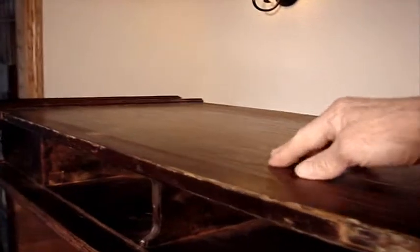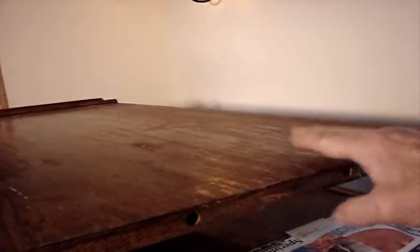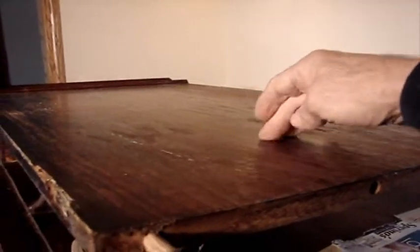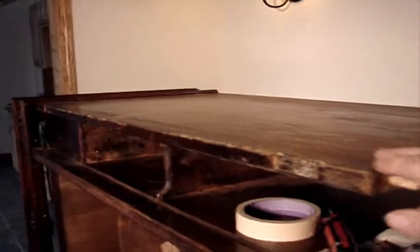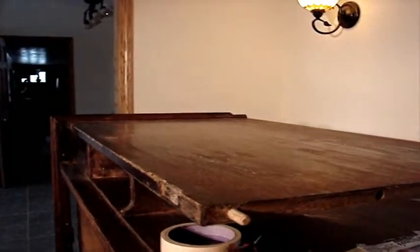I've managed to glue this side down. As you can see, it's not very good - the veneer is pretty rippled. It was very hard to get this glue down. In the middle here, even though I worked the glue in as far as I could get it, there's one little place where I can see there's a loose spot, but it's so minor I'm not going to fool with it. Saving this thing - most people would have thrown this out. But the veneer is nice and tight now, it's been glued and clamped all the way around. I have the doors off of it and I've been gluing the veneer on those as well.